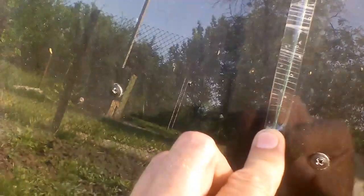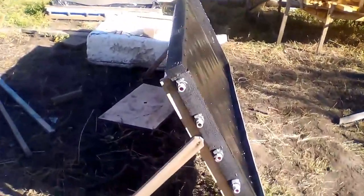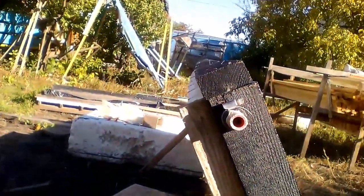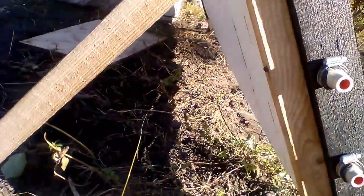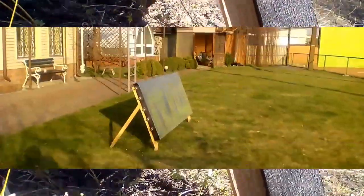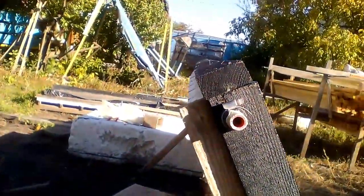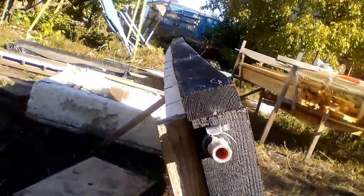This is an alternative to those primitive joints, but obviously it should be a transparent polymer with a lifetime of at least several years. Now I'm showing my mistake where the large weight of the glass sheets formed a wide gap over three months, and therefore this glass sheet noticeably sank down, and now this cord is outside the glass sheet. We understand that this lower wall of the collector should be fixed more securely. This upper wall is also very important, and we have to pay attention to the bend of the upper part of the collector, although we see that the lower part of the collector has no bend. That bend formed due to the weight of approximately 20 liters of water inside the sleeves during 1,500 hours of one position of my collector and 3,000 more hours of another position, and the upper wall of the collector must resist this bend. However we see that my upper wall makes it badly, and therefore we must change its design or its fixation to the collector.